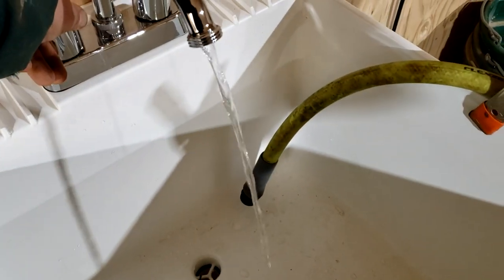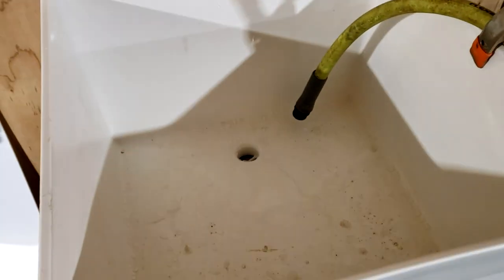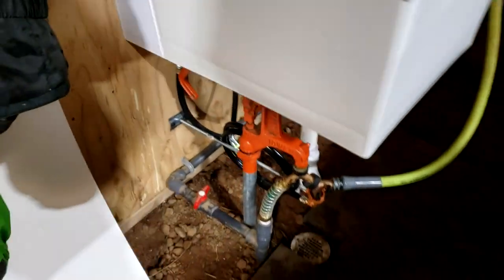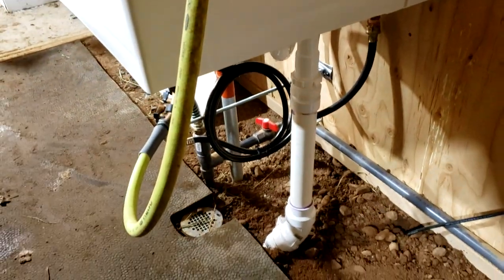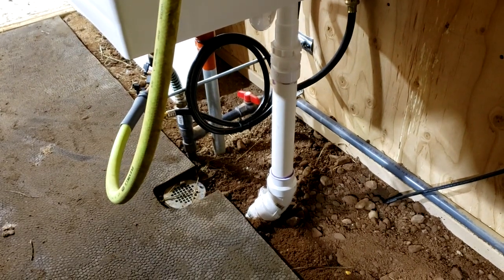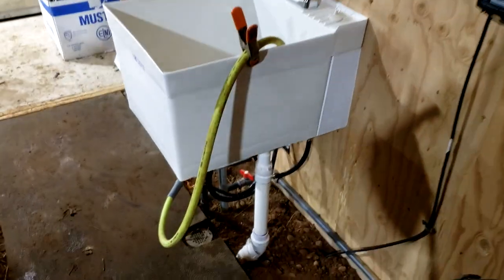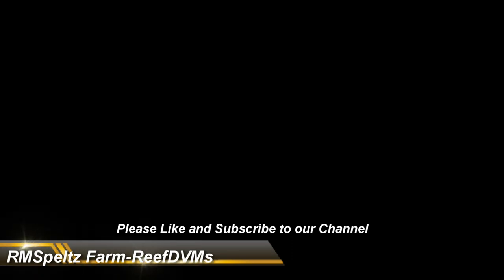This will be a nice solution for us — we won't have to deal with it freezing up again. We don't run a lot of water in this sink, just enough for basic milking, cleaning, and hygiene. The water line is mostly used for the water in the barn. We left the floor drain in, cut off the plumbing line the sink used, and redid it into this new setup. The alarm is on the wall and will tell us if that second barrel ever fills up. This is how we fixed our frozen sink line — please like and subscribe and support our channel!